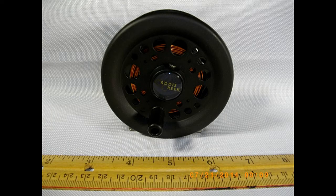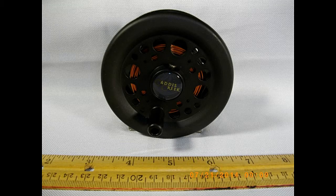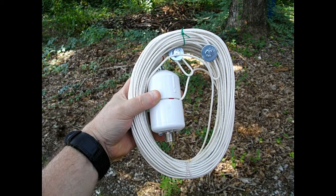Some words of caution: I built this antenna for weight considerations — it's very lightweight at only 7.8 ounces. As such, it's not very robust and not designed to be installed a great number of times. You can use larger wire, or go with a homemade antenna or one bought online made out of 18-gauge wire, like the one I bought on eBay — excellent price, almost cheaper than building it myself, and it comes with the balun. That 80-meter dipole is more robust and would stand up to more installations; it could even be used as a permanent antenna.